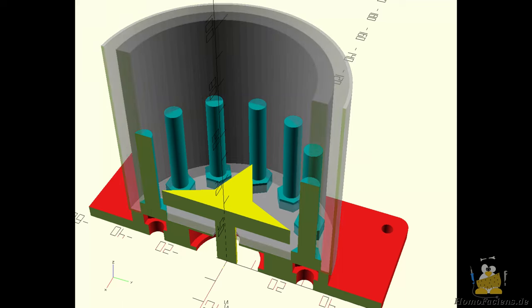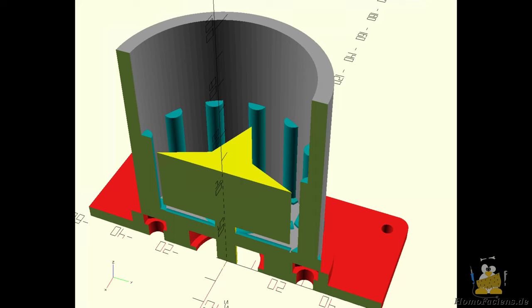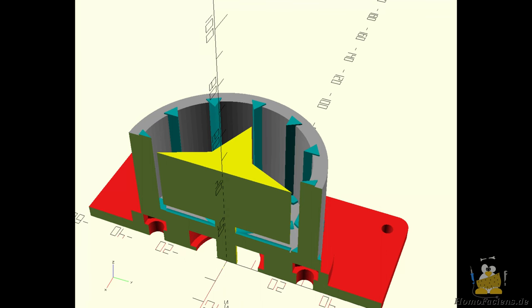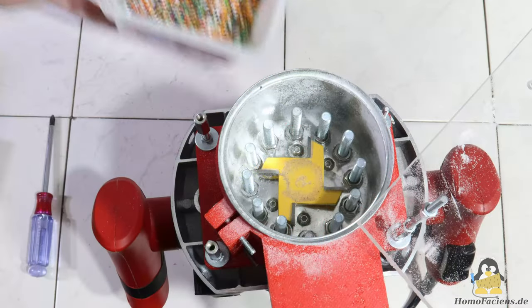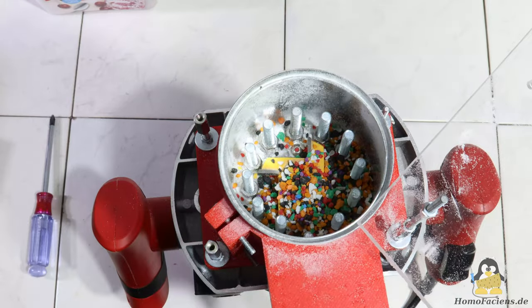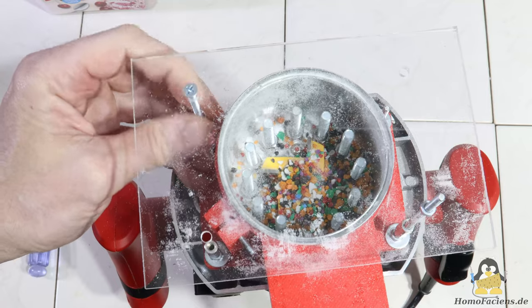This needs to be prevented by changing the design. The stator should be integrated into the wall of the can, which significantly reduces the diameter of the chamber. Furthermore, the cutter is currently more or less only grinding on the outer edge. Appropriate gaps can also be formed between the bottom or lid of the can and the rotor, and a cutting tool with wider blades should contribute to higher material throughput. The stator does not have to consist of screws — replaceable plates are also possible. The chamber can be made significantly more compact. Since ground material is permanently removed via the sieve, fresh granules can also be permanently supplied in principle with a different lid construction. The grinder is suitable for continuous production of plastic dust.